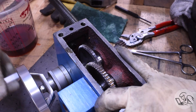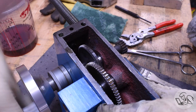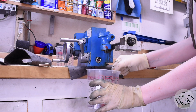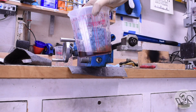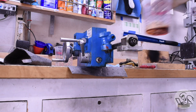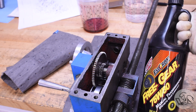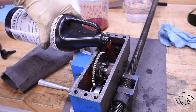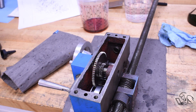Let's see how that motion is — oh, that's brilliant. Perfectly smooth, no more signs of stickiness. That's looking really good, so I think we may have it. While I have it all apart though, I'm going to change the oil because it's never going to get easier than this. I'll drain that out — it's been at least a year since I did this. Yeah, that's looking a little on the dirty side; it should be bright red. To refill it I'm using 75W80 manual transmission gear oil — what the manual recommends, and it's always good for unpressurized oil bath systems like this. The only thing you really can't use is automotive engine oil because it has detergents in it designed for pressurized oil systems with filters. With a passive oil bath system like this you want impurities to fall to the bottom of the sump and stay there.